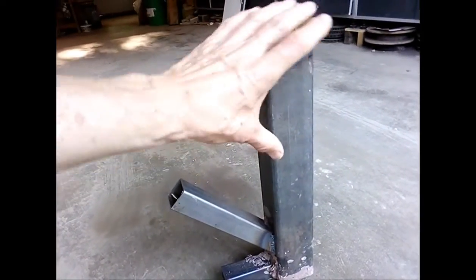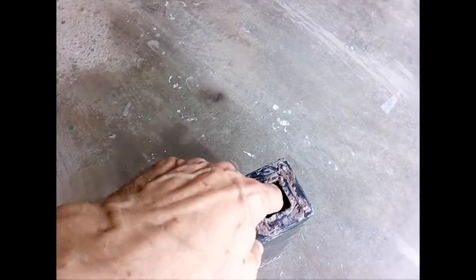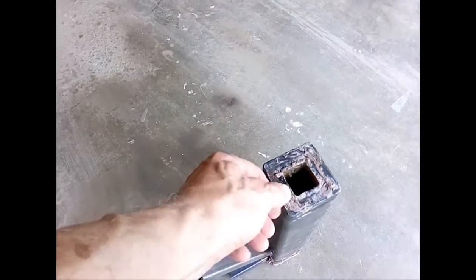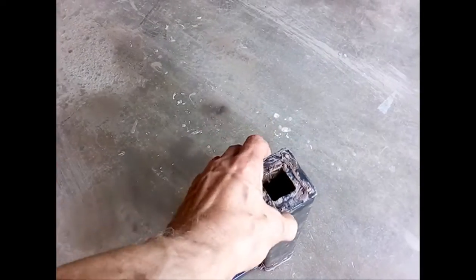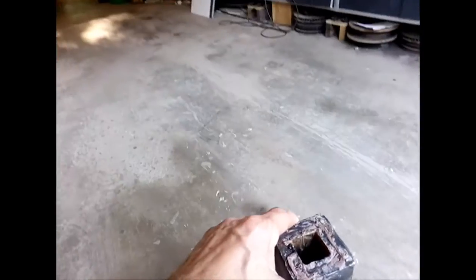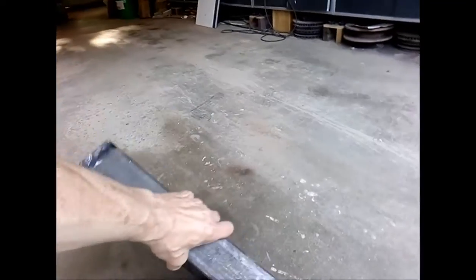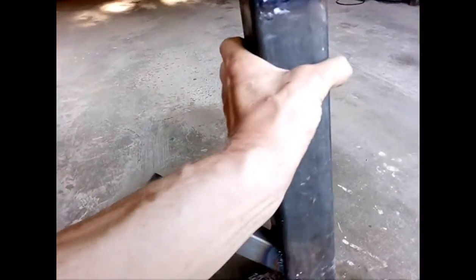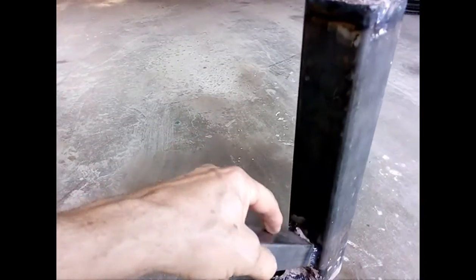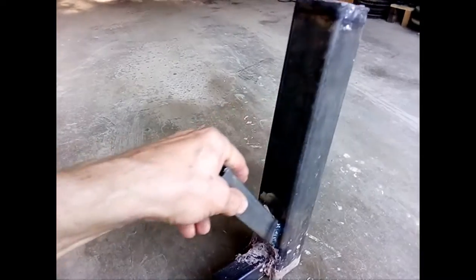One of the things you'll notice is I got a nice big thick pipe here, and on the top you can see I have the chimney, right? What I've done in here is, you can see I've put mortar in here, and I was using it as insulated fire brick mortar. And the problem with it is that it's not made for casting as I was using here. It hardens really good here, but I'm pretty sure if I looked inside here, you'd find out that it's still wet, right? So I fired this thing up, and then all of a sudden it started bubbling out here after sitting for over a week, right?